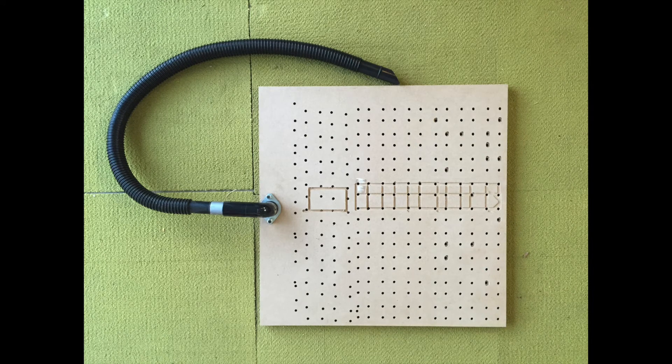Here is the top of the vacuum board and you can see all of the holes going all the way through to allow the vacuum to touch your work piece. There are also some traces that connect between some of the holes in the center of the board, just to increase the amount of surface area that the vacuum will pull on your work piece to give it a better grip.